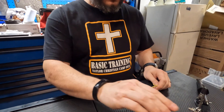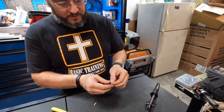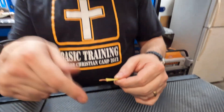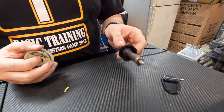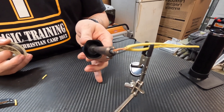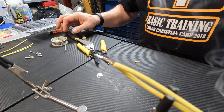I'll start you off with a classic solder using a soldering iron and some wires. We're going to strip back almost a half inch of the wire because we're going to do a twist connection. Classic way of doing this is to take and lay them right beside each other, twist them together. Once you heat up a soldering iron, you're going to want to tin it just a little bit — that is adding a little bit of liquid solder to it as it melts, because liquid transfers heat better than just air. Now I'm going to hold that to the wire. We're going to heat the wire and melt the solder to the wire, not the soldering iron. As that heats up, we're going to just hold the solder on top — and it's going to suck that solder right in.